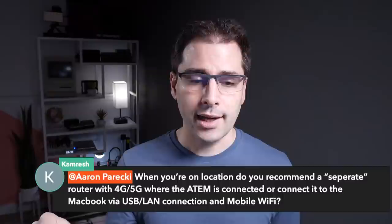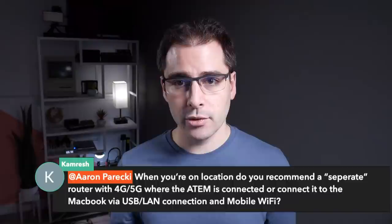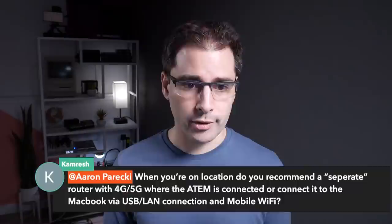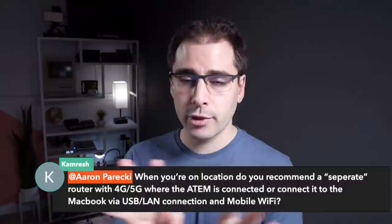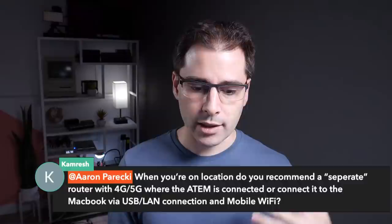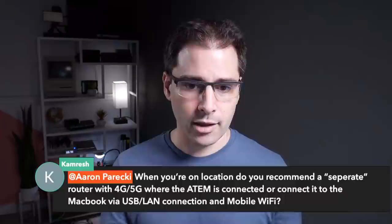That can be done a few different ways. It can be done by tethering a device to my phone, either Wi-Fi or USB. It could be done by plugging an Ethernet cable into the venue's internet. It could be putting a SIM card into the mobile router. So there's a bunch of options for that, but how that gets internet is a separate problem from how you talk to the stuff in the box. That's the way I like to deal with it: treating those as separate problems, so that I'm not reliant on that device having internet to control all of the things on the desk.